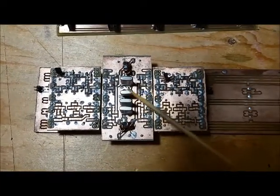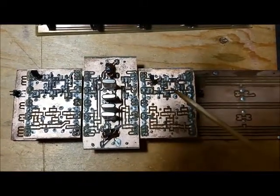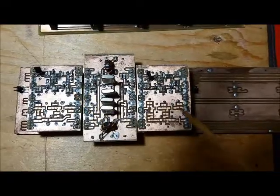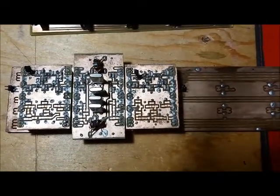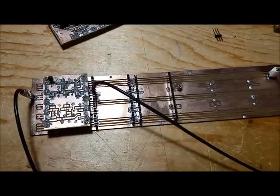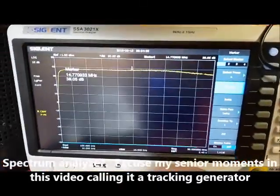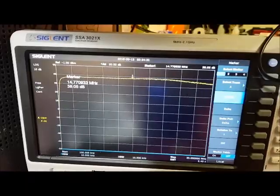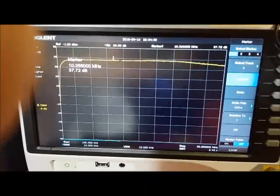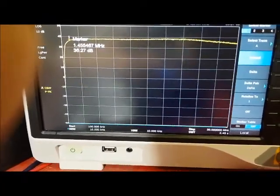With this latest design, as with the previous one, I sometimes got some oscillation, so I thought I'd go straight to the punch and test this configuration to see whether it's stable. In this video I'll be going through some tests to check the stability of this backplane design. Testing the gain for the first bi-directional amp connected to my tracking generator, I'm seeing approximately 38 dB of gain, and it's fairly flat right across with a roll-off point at about 1.5 MHz.